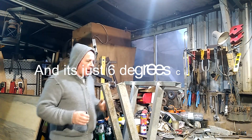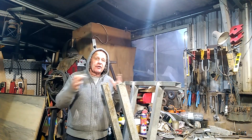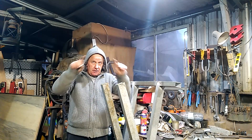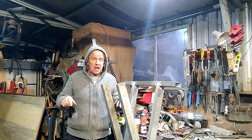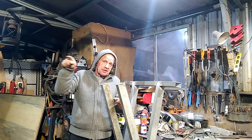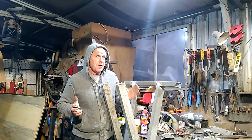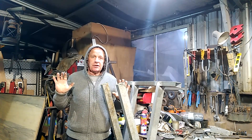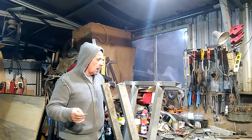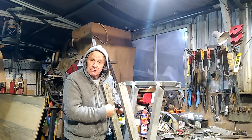It's evening two, video two in the shed. I've made the frame of the table and I've made the leg assembly, and I'm now joining the two together with the pivot points. The wheels have to be assembled inside the perimeter frame of the top of the table, which is pretty hard because I want to do an enclosed channel — that will give so much more strength if it's an enclosed box. That means a thin slot for the axle to run through running down the side of the build, so it's going to be very strong, but of course it gives me assembly problems. I only need to assemble it once, but somehow I've got to get these wheels assembled inside a slot with the axle running through it.